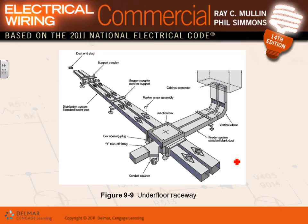Here you go. Look at this. I've never wired something like this, but you can come from the panel, guys, under the concrete, completely in the concrete. You put your channels, look at that dual duct, come to a junction box with separation here, and you can go everywhere, guys, under the slab, with a junction box and devices. Any comments, any questions, guys? Any comments about this wiring method? Where would you use it? A huge open office.